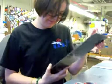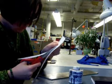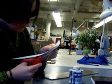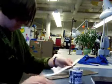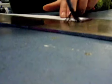For this dagger, we'll be using Damascus steel, which has some very nice patterns in it. After the patterns are cut out, it's time to put them to the steel. This takes a bit of careful lining up so we don't waste a lot of the steel. But after we're sure the patterns will line up, we paint the entire piece of steel with ink, overlay the pattern on top, and then use an etching tool to scratch the ink around the edges of the pattern. This makes a line that is much easier to cut along.